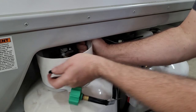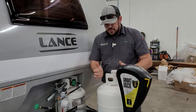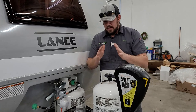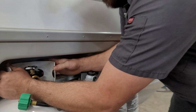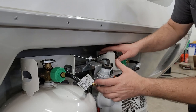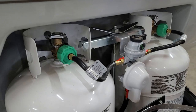The cylinders can be exchanged or refilled. When transporting, keep them upright and use the dust cap to protect the inlet. To reinstall, rotate the cylinder back into place, connect service hoses before tightening everything down in case you need to rotate slightly, then snug the wing nut down — it doesn't need to be over-tight, just snug to keep things in place.